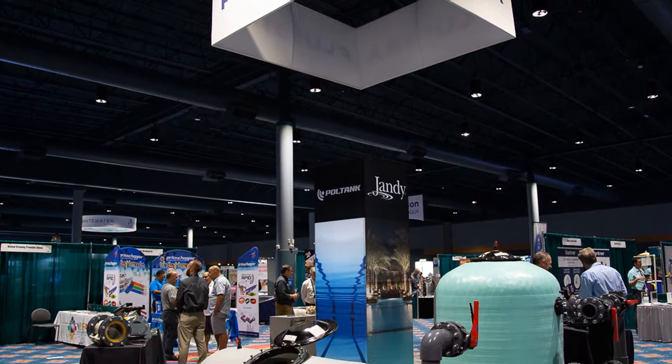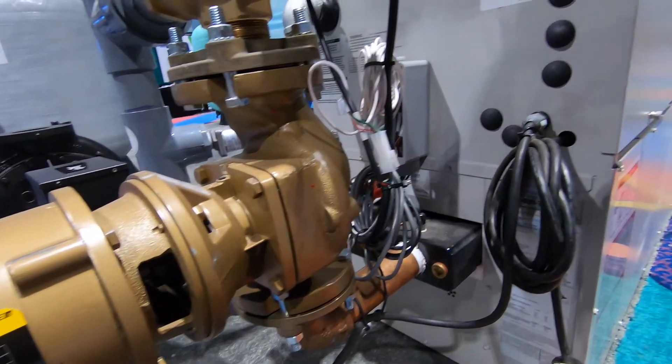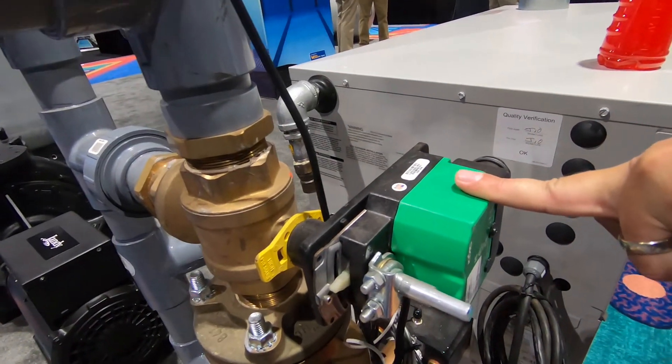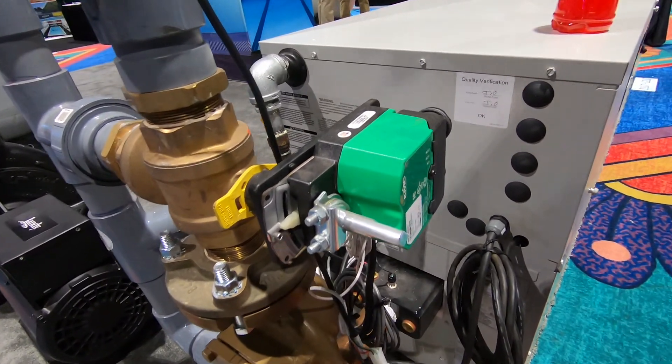It's the perfect matchup along with our other equipment. These units are ASME certified. They have copper nickel tubes and a three-way valve, which helps modulate the water so we always maintain a constant 130-degree or higher water temperature to prevent condensation.